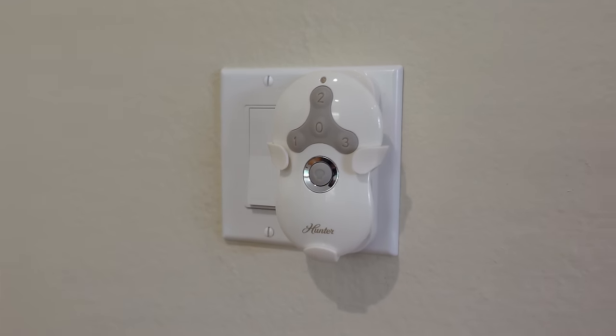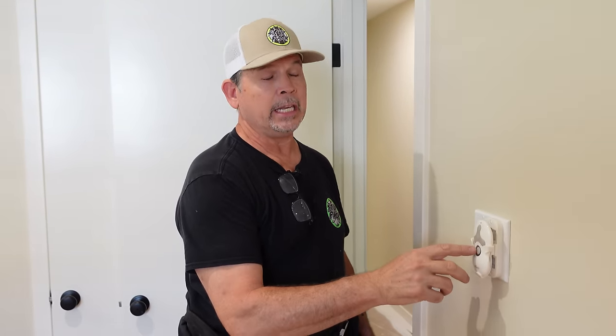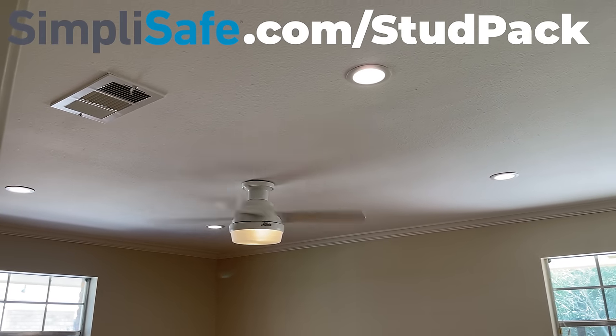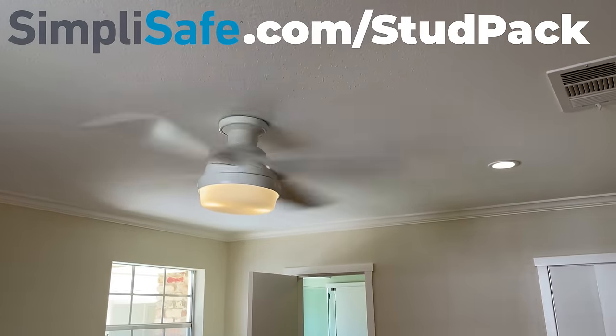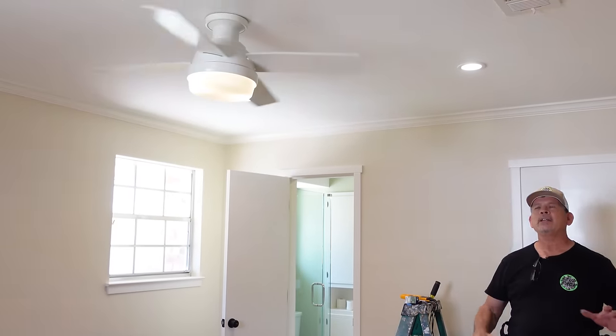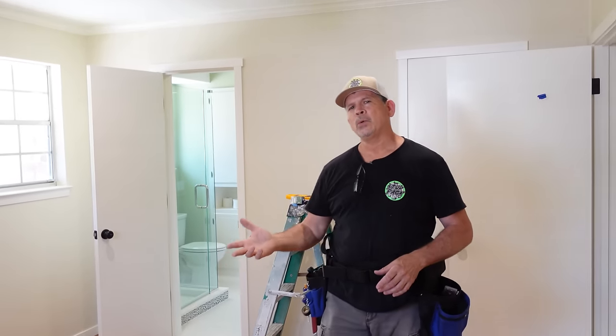We are all done. We have come a long way from that old blue room with an old ceiling fan in the middle. Now we have three switches, full dimming capability on our LED lights, we can control the fan at three speeds, and we can even dim the light on the fan kit. These Halo LED lights bring a whole modern dimension to this room. So run a switch leg to your light location, smash it for us, ask a question, drop a comment, and we'll see you on our next video.